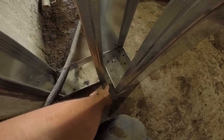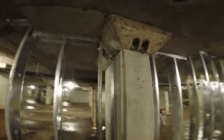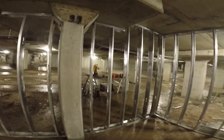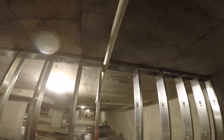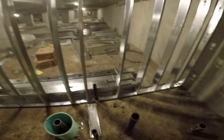Leave three quarters of an inch there for the drywall to go in — for five eighths or even half inch drywall, three quarters is plenty. You square it all across, screwed all in. A stud landed here on the angle so I just added a piece of track and ran the stud. Wherever a 16 is supposed to land, try to get a stud in there. This one I moved over because it wasn't an important one — there were no bevels planned to land there. Otherwise I would have added another header and put the stud where it goes.